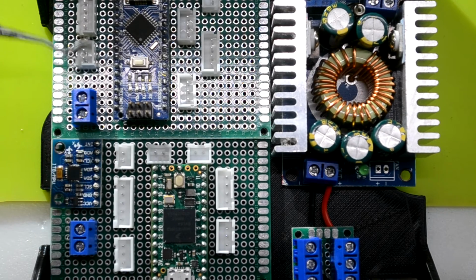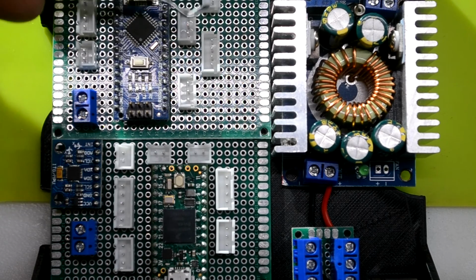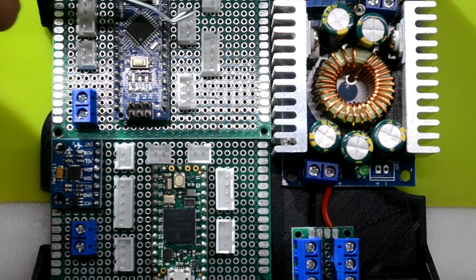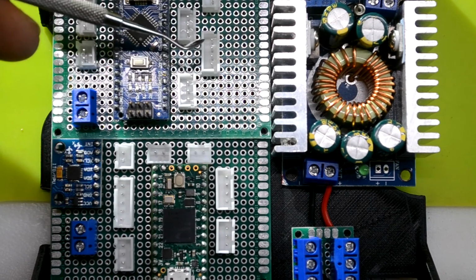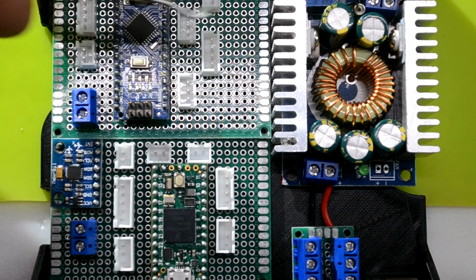Okay, then up here on the Nano circuit, again we have power in, 5 volt in, and let me see if I get this right. This is I2C in. This is the switches in the hood, the top cover of Nova. Power switch for the OLED and dimmer for the RGB. Then over here I split this into 2 connectors for the SPI OLED. I don't think I use or need all pins for that device, so I may end up only needing this 4-pin one rather than both. And then I have the ultrasonic sensors and then the RGBs. So these are all going to the head of Nova, where that equipment is.